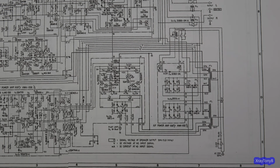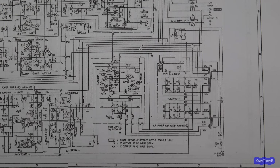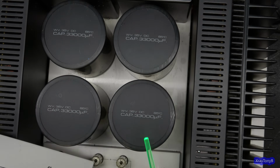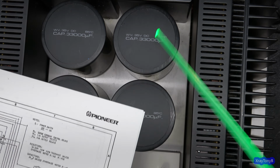They know that the only time you need full current is for impulse power, when you're driving the amp with those big instantaneous bass passages and things, the big transients. And as such, when you have a Class A amp, you really can't scrimp on the power supply. You have to have a really solid transformer, really heavy rectifiers and so forth. Hence, these gigantic capacitors and these gigantic transformers here for just a 30-watt amp.